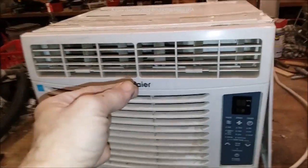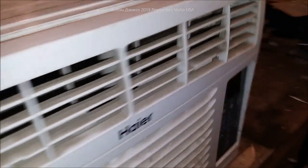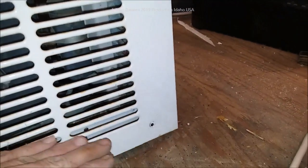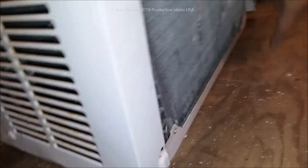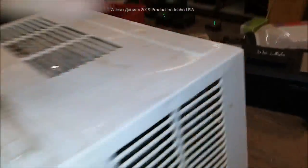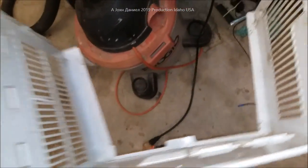What I've done is taken out the screws in the unit. There are some here and here, and you'll have a few screws for your mounting rail and screws here, here, and here. You just look for the ones on the outside — they're not going to be involved with something mechanical on the inside. There are a few more small sheet metal screws up here as well. The cover comes off with two lower screws, and then you have the screws for the chassis — but you don't have to mess with those. This is called the chassis; it's the body the unit sits in, and the rest of it comes off fairly easily, leaving you with this nice big sheet metal piece.